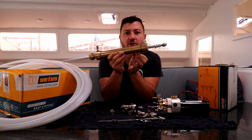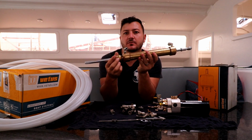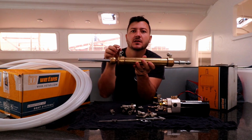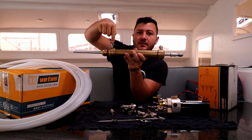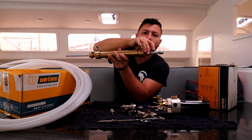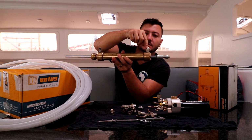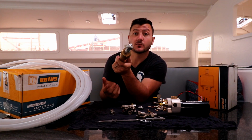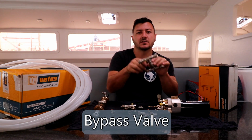And secondly, we've got the hydraulic ram, or the hydraulic cylinder. This one we just removed the end cap that goes on here, which is the support where it mounts. It feeds hydraulic fluid in there and moves the steering column that way, and then feeds the hydraulic fluid in there and reverses it back at the pressure that the system operates at. Thirdly, we have a non-return valve.